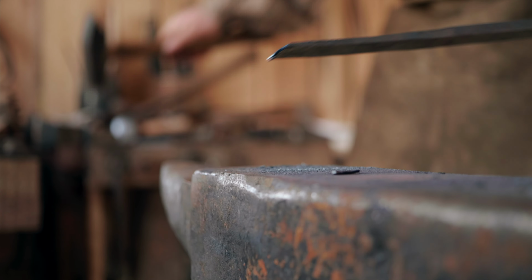But anyway, we will come back next week and finish this up. I'll forge weld this back on. I'm going to punch a hole through it, put it back on, forge weld it on. I'll have to cut a slot in it and finish the handle of the bolt, and then make the back plate and the staples, and the bolt will be done. So that's a major disappointment, but I know what I did wrong, and so I'll be able to be more careful next time.